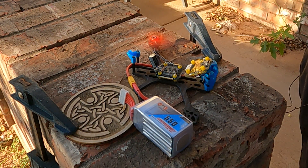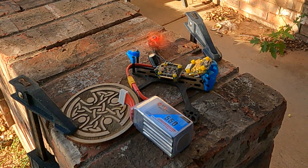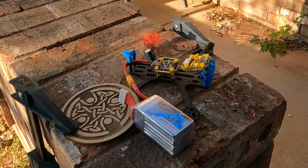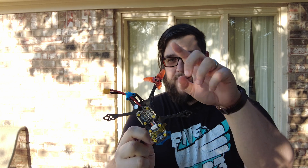And that worked pretty well. I slammed it in there and it just kept taking it — you even saw it stop the motor a little bit. These are 3,800 kV motors, which is not the highest end on 4S, but it is the highest end on 6S. So let's see if we can draw a little bit more amperage and blow the crap out of the ESC. 30% throttle again, 3,800 kV motors on 6S — that is 33% more voltage with no motor output limit. So 6S didn't kill it either. That is one super torn up prop — that's all that's left of it. The ESC wasn't even warm to the touch.